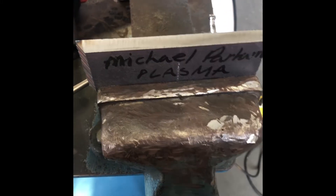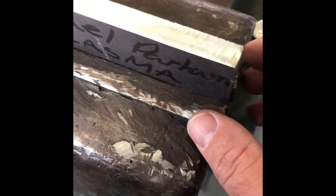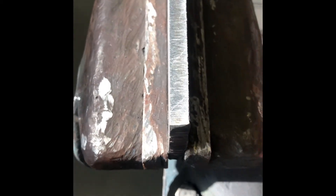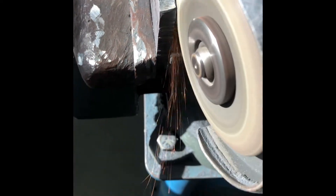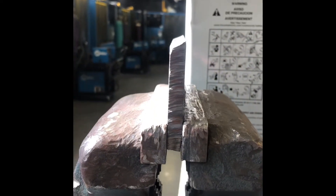Alright, so that's our bevel. A little bit of grinding later, we got it done. It's nice and smooth, doesn't have any jagged edges. It's almost like a machine done it - that's what I want to see. Sometimes you'll get some little flaky edges off the back, real sharp. That is a beveled edge - 30 degrees - that's what we want.